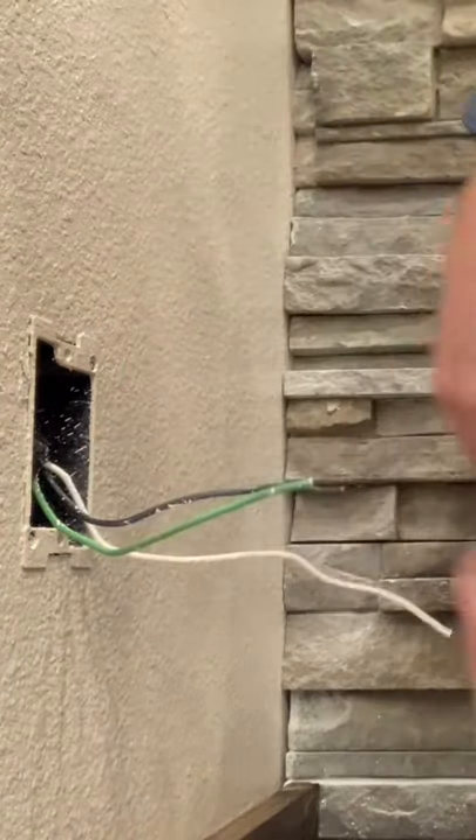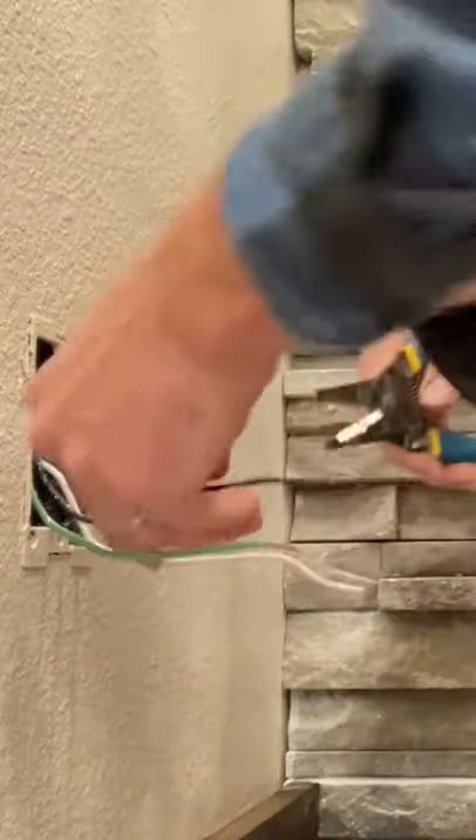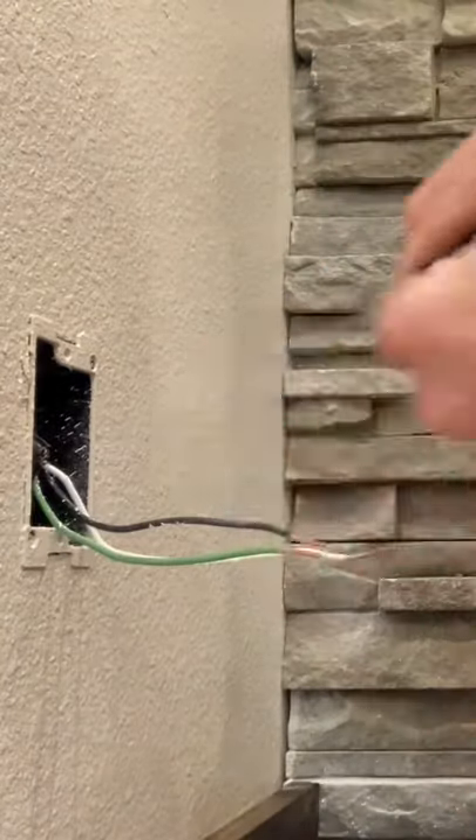You're going to test the wire to make sure it's not hot. You're going to cut the wires to length using your hand as a gauge. Use this to trim the wires to get the insulation off the end, and then you're going to take this tool also and use this hole to bend those over.